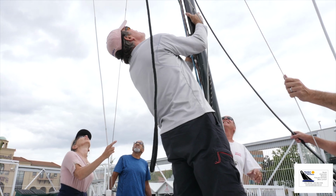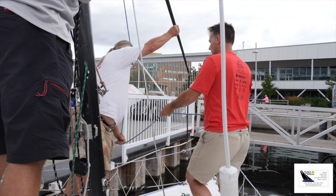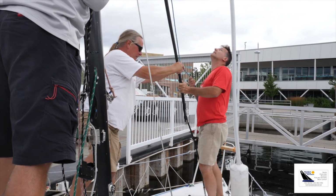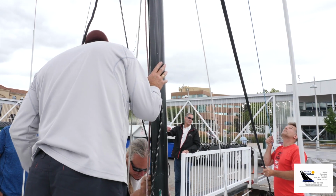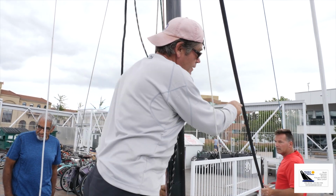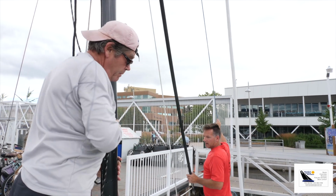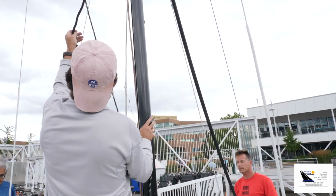Check those side stays. This is the forestay. So you're using your spin halyard as a temporary forestay? Correct. He'll hold the stick up for you. I should be able to release all the pressure. Okay, let's put some load on that blue one. So you make sure you have a replacement forestay, you have a halyard on, and make sure it's all down before he releases this.